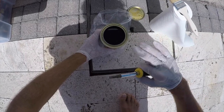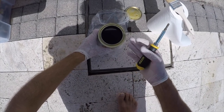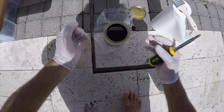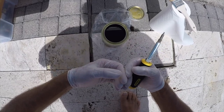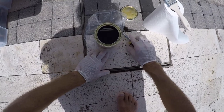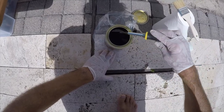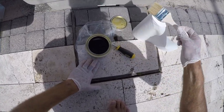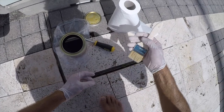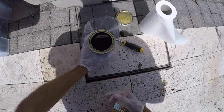If you don't get all of the skin layer, don't worry. What happens is that skin layer sinks down to the bottom and — this may be a shock — it actually sort of becomes part of the varnish again. I do this all the time and there would be a whole bunch of skin stuff in the bottom, but I've used paint all the way to the bottom of the can and it's still been all good varnish. If you get a little bit of clumpy stuff when you wipe it on, just take a little bit of paper towel and grab it and pull it off the wood.